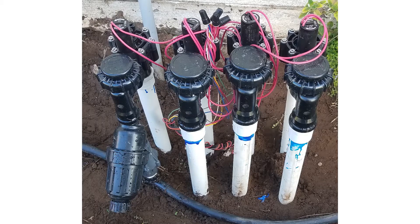The first most common method, here in the moderate climates of the west, is the anti-siphon valve. It's installed at least six inches above grade. I'll go into more detail about proper sprinkler valve installations in an upcoming video.